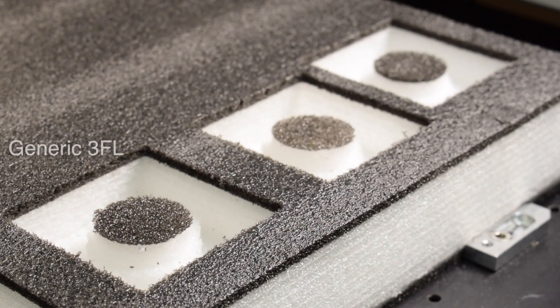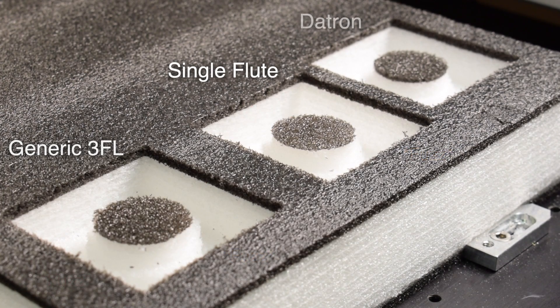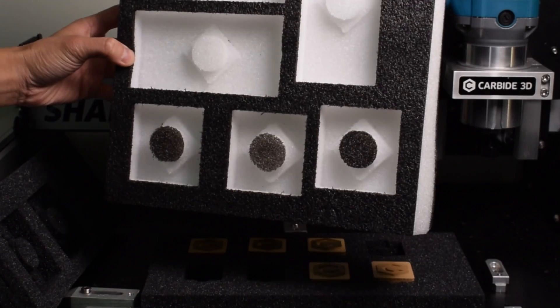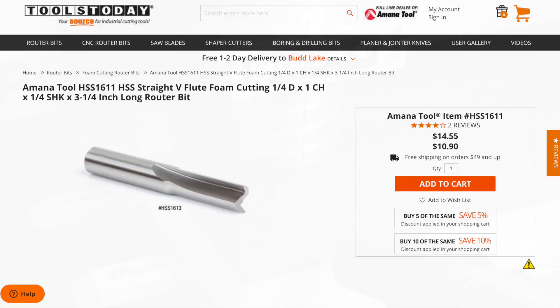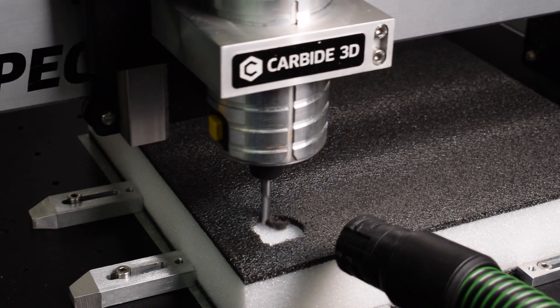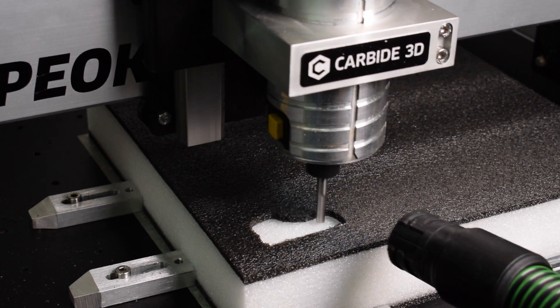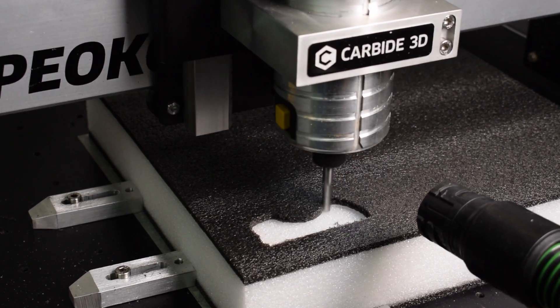Take a look at the top edge in this polyurethane foam test. On the standard geometry cutters there's a little more tear-out at the top. With the Datron's super shallow helix, the edge is a lot cleaner. In fact, if you look up some other end mills there are even some straight-flute foam cutters out there. The foam structure of polyethylene lends itself very well to low helix angles - it's very similar to why up-cutting end mills suck in plywood.